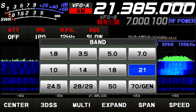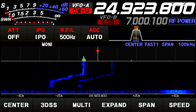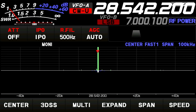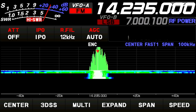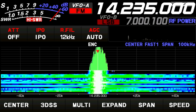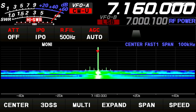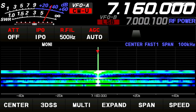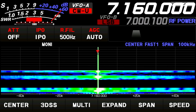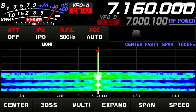On 24 megahertz the tuning was pretty much instant with only a slight flicker on the SWR needle — another usable band with this 20-meter length of wire. 28.5 megahertz also seems to be in tune, as does 29 megahertz, though that may have been related to a previous tune on that band. When we dropped to 4 megahertz, the best tune it could make was just over an SWR of three. At 7 megahertz and 3.5 megahertz it continuously attempted to find a match but ended up failing. I don't think this is a fault with the tuner — it's more related to the length of wire used. I believe my wire is actually resonant on around 40 meters, and with remote tuners the antenna should not be resonant; more research on that is required.